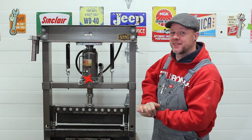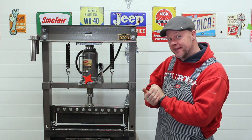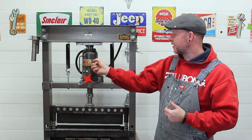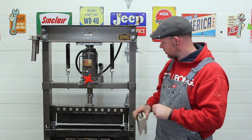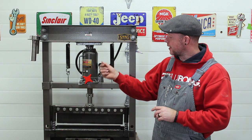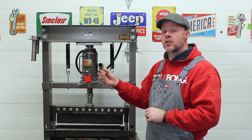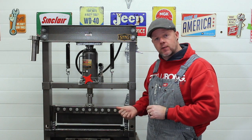And done — mostly. There's always something extra you want to add. I appreciate you sticking with me through the whole video and the whole build. My Harbor Freight 20-ton press is now super useful — I actually used it today. Let me recap: I swapped out the existing 20-ton jack for an air-over-hydraulic 20-ton, which is much much faster than the hand jack. I have a foot pedal; I'm just waiting on hoses from Amazon before I hook it up. I also designed a release knob in Creo, printed it in PLA, put some paint on it — it's been running for two years and I just moved it to the new jack.